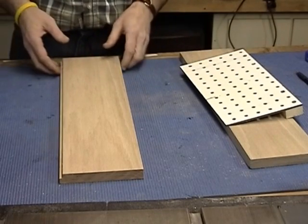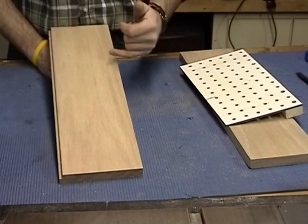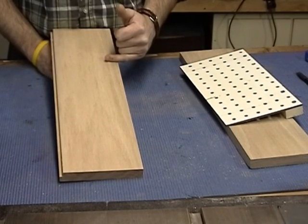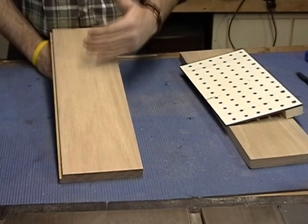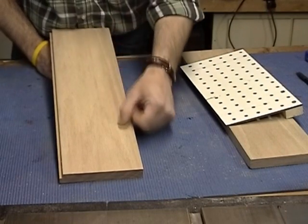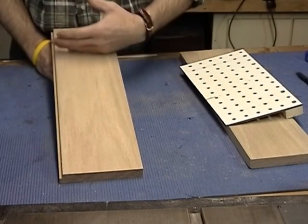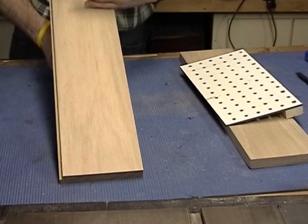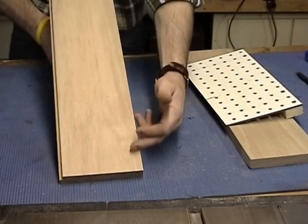Now here's the thing, in my opinion on adjustable shelves, when I put adjustable shelves in a cabinet, I will make my center mark where my shelf is going to sit. From that mark, 1 inch down or 1 inch up, I drill 3 holes. My center hole where the shelf's going to sit, or I have the option of adjusting it up by 1 inch or down by 1 inch. There's no need to drill holes up and down both sides all the way on this cabinet, because you're really not going to make that drastic of an adjustment on your shelves to space them out with the size of this cabinet. And most cabinets, I only give that option of a 1 inch up or 1 inch down in any direction on any shelf I use.